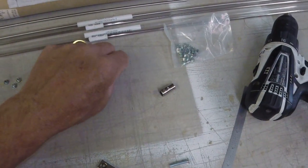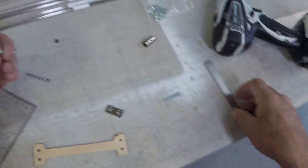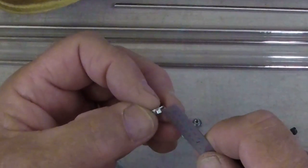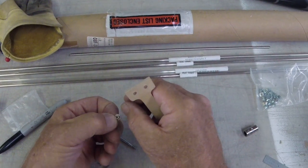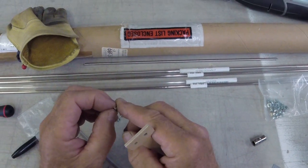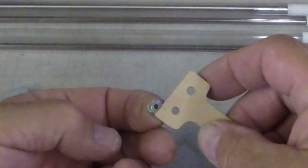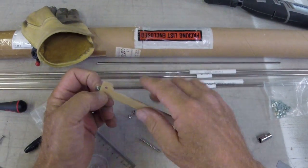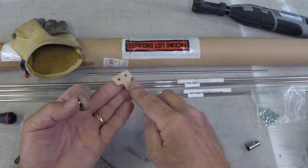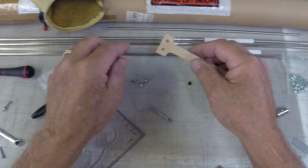440s. The sticky outy part, it's too long to pull this off. Here's some that are not cut. And look at that, it doesn't even have teeth on it. That's a weird one. It's a great one to use for an example. See how long the barrel is here. It pretty much goes all the way through right now, which is really great for eighth inch ply if you don't care about what's on the back side. But I want this to fit down flat on the epoxy, on the fiberglass of the cowling. And so we need to recess it.